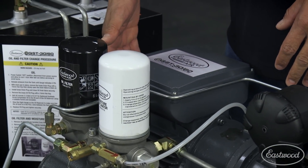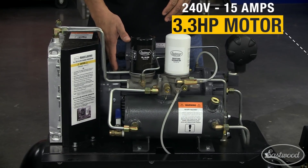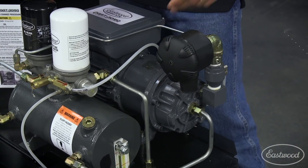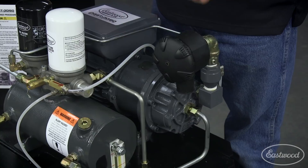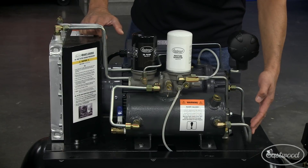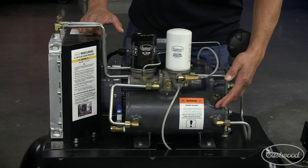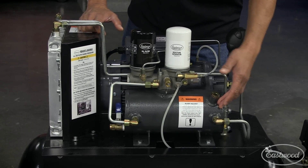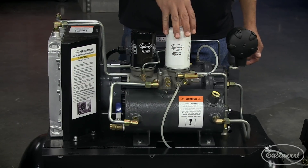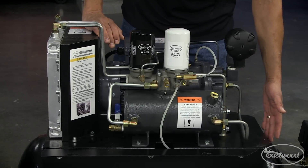With the cover removed, you can see the heart of the unit here. It starts off with a 240-volt, 15-amp electric motor driving a direct coupling to our scroll compressor right here. Air enters through the air intake, is compressed through the scroll compressor, and then exhausted out here. Through this line, we go into our oil separator tank. What this does is it drops out the majority of the oil from the air-oil charge. It comes up through the aluminum manifold into the moisture filter, which removes about 90% of your moisture out of the air charge, then from here down into the tank to be pressurized.